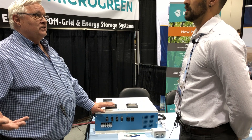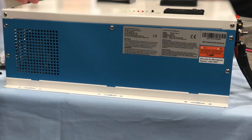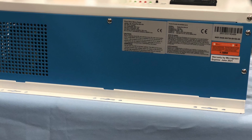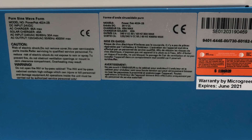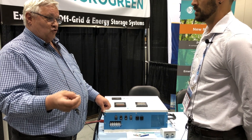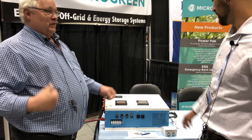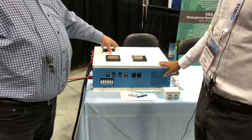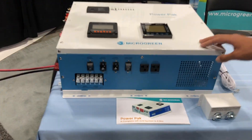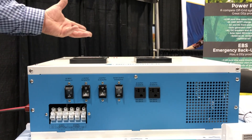It's great for even small houses. If the heat items like stove and heaters are gas, they can run a small home. Would you be able to run something like a microwave or a vacuum? The beauty of this thing is you could actually run a vacuum cleaner, a microwave, a toaster, and a water pump all at the same time. That's why we picked a four kilowatt inverter — because whether it's a two kilowatt or four kilowatt inverter, the difference in price is so marginal. Why not have the power if you want it and not later say I wish I'd gotten a bigger inverter?